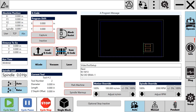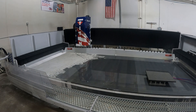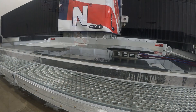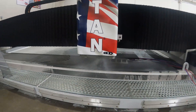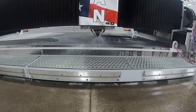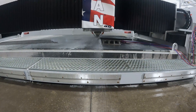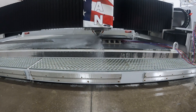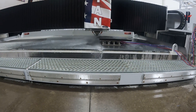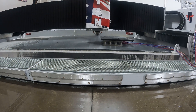With the proper program loaded, press cycle start. The first tool in our program is z-wheel one. I feel comfortable not stopping to test this tool because we've already used it in many other styles, but I am still going to run it across the entire edge to straighten it out so I can use it as a baseline to adjust all the new tools. Even though it's tested, I'm still going to be ready to press the cycle stop button just in case something isn't right, like if I see sparks from taking too much material off.